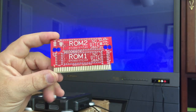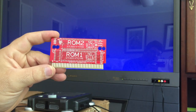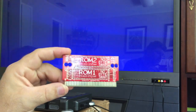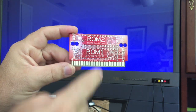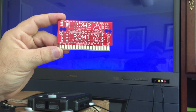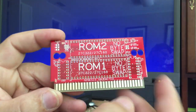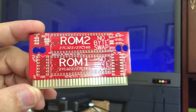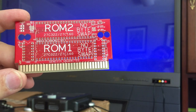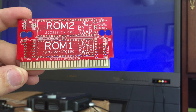We plan to offer a kit where if you want to make a multi-game — either you combine several games on one chip, or you use one game on one chip and another game on the other chip, which is the simplest multi-game to make. This is the no-SRAM version. If you notice it says 'no byte swap' here — this board does not require you to do the byte swap when preparing your ROMs. You just burn them native to what they are and you're good to go.